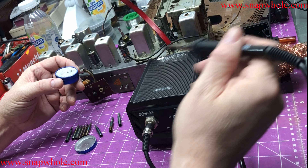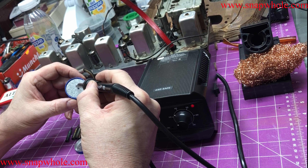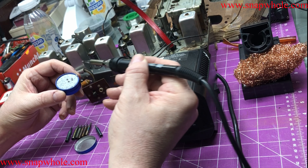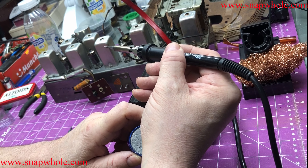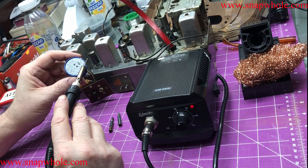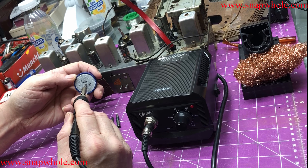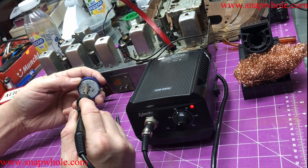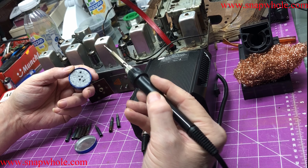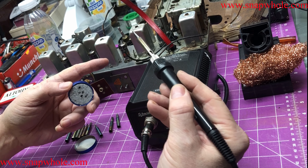If you have a tip that's bad, you want to dip it in here and have it melt. That soldering iron wasn't hot enough the first time because it didn't go down into the paste, so let it come up to temperature again — I'll try 600°F. You don't want to go too high or it won't stick. Do the original depth of the tip — there you go, see a nice tinned tip that will now work correctly.